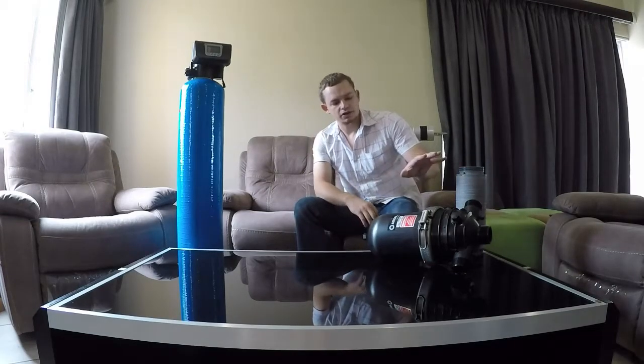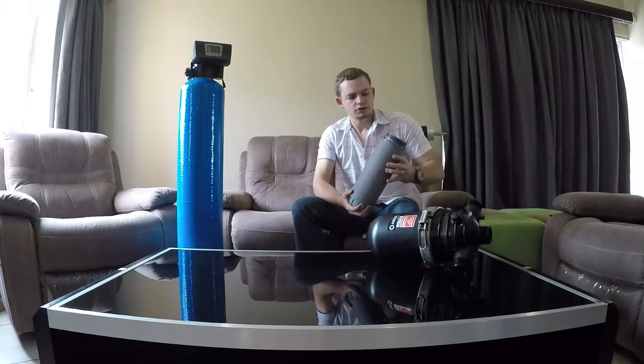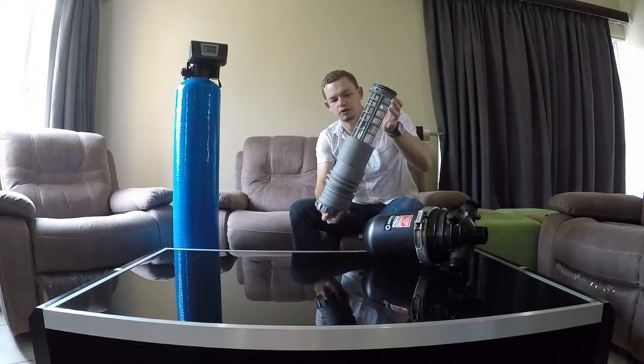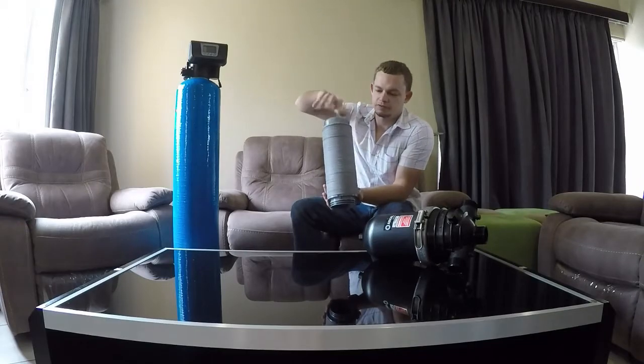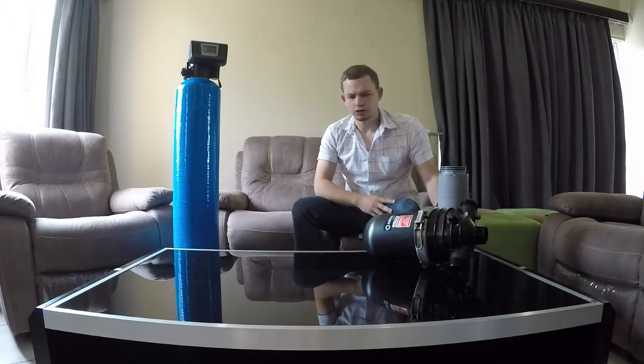If you fill a bathtub with water, you'll start to see some discolouring in the water. If that's the case, we recommend a disc filter, which is a very nice and simple filter. Simply remove the cartridge, wash it in a bucket, put all the discs back together, tighten it, put the cartridge back, and that should take you back under 0.5 NTU.